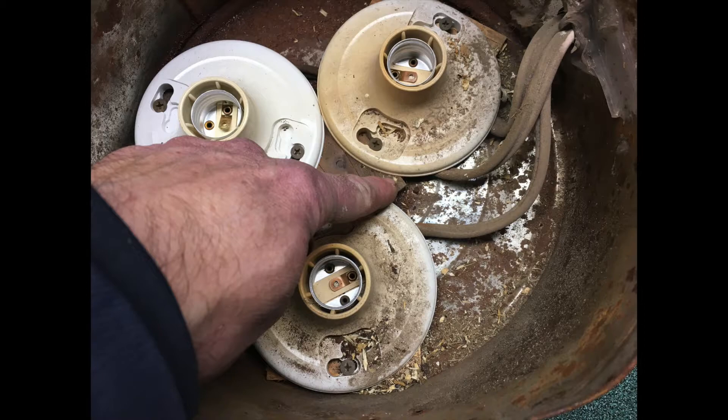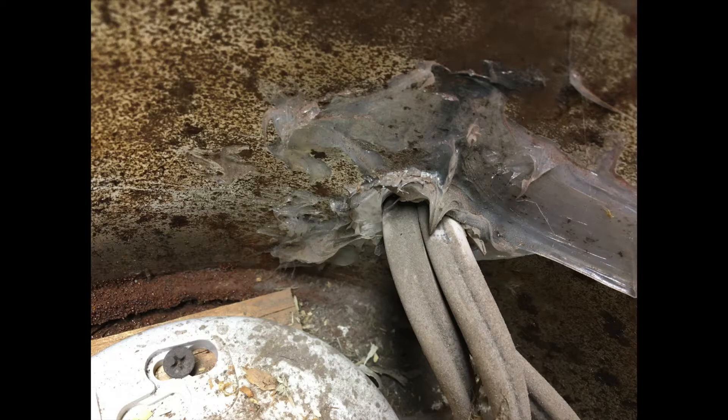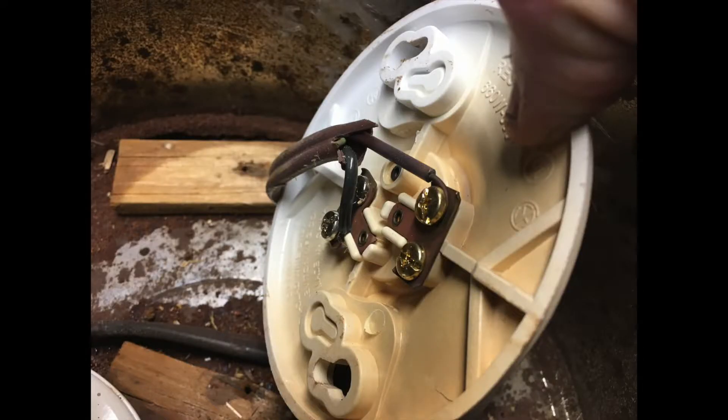The bases are actually elevated, sitting on little wood blocks, and that lets the wires that come in through the side of the can have space. They're attached to the bottom of the lens part, and I'd drilled a hole in the side and used epoxy or caulking to keep the wires from rubbing. You can see on the bottom how the white plastic has turned brown and the wires — one is black, one is white — are now both black, and even the casing is black. Everything got a little too hot.